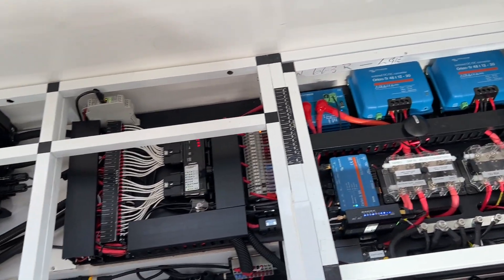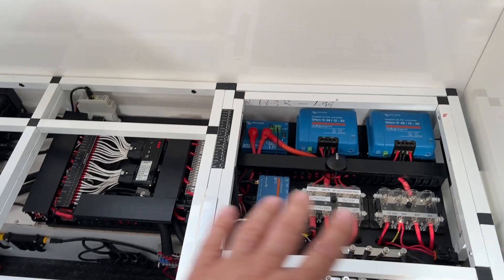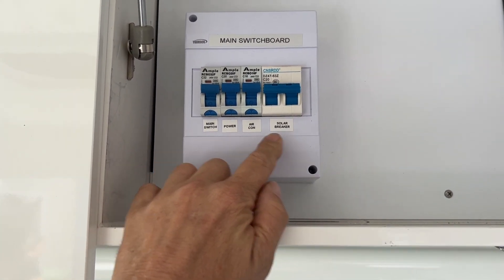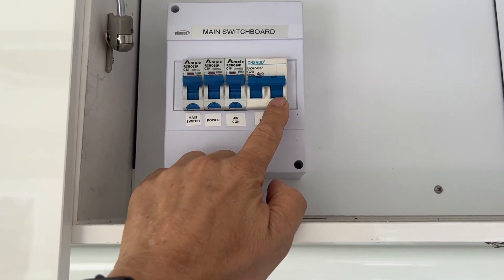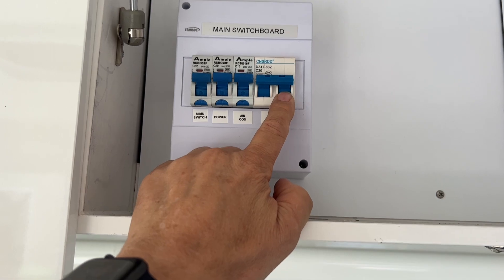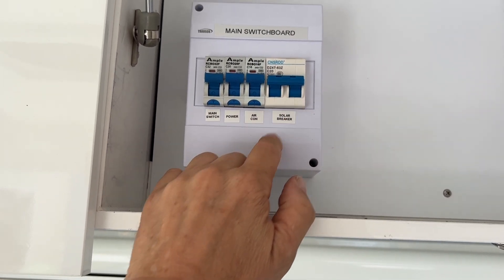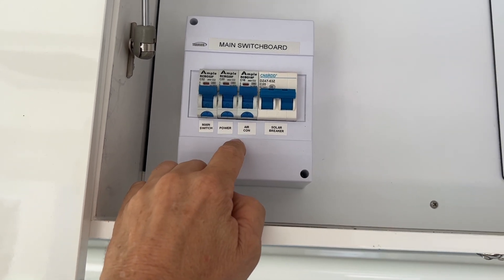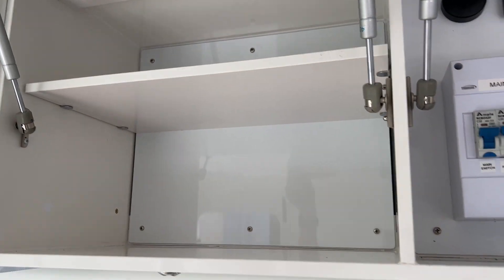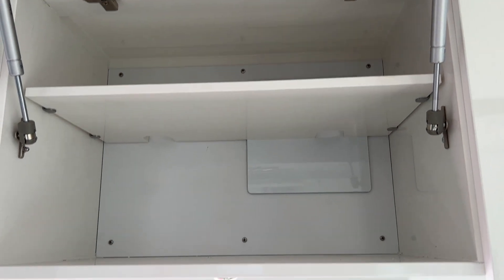There's a lot in this van and it's all labelled. Compressors are at the bottom, and that fits under the bed quite neatly — the inverter over there, batteries here. Up on the board above we've got a few extra breakers not normally fitted: one for the aircon and a separate breaker, and the solar PV breaker where we switch both the positive and the negative. Most people don't realise that if the negative goes to ground it'll create major drama, so we isolate both. If it goes to ground this will trip — it's a residual current detector on solar — and then we've got the main switch power coming in. The remaining devices up here are removed, so there's storage space in the cabinets.